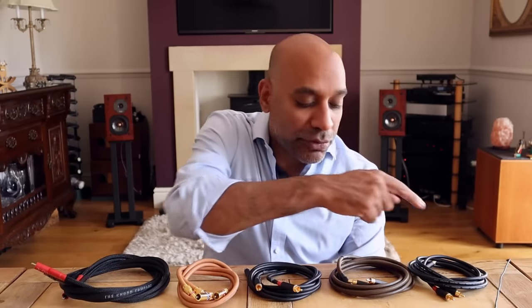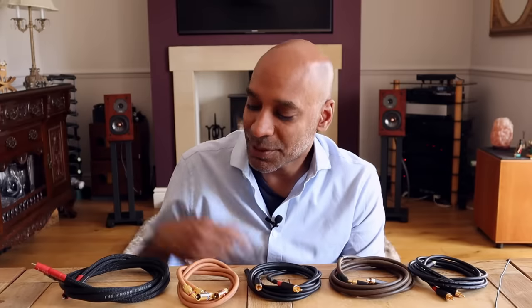I did a video on cables when I started this channel over a year ago, so I won't go over everything again, but it's important to summarise the key characteristics. By far the most important is DC resistance. All three pro audio cables have very low DC resistance — below 100 ohms per kilometre. Audiophile brands don't generally publish full specs, which is shocking and adds to the snake oil speculation. My multimeter showed no discernible resistance on the Chord Company Signature, so it's likely below 0.1 ohm per metre.